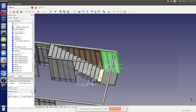Yep. One team can install the panels, because you've got to install the panels first, and only after that can you mark, otherwise your marks are hidden. So install panels, do markings, but we can cut the 2x4s right now. Let's do that. And I'm willing to mark the whole stairs on the panels, everywhere the 2x12s are supposed to be, all along the wall, and we'll have a direct map as we go up. We'll also be able to find out if we're off by a little bit and adjust it.